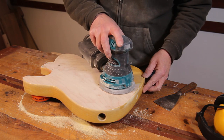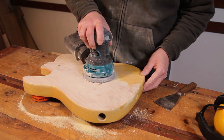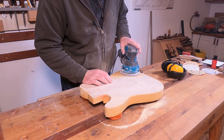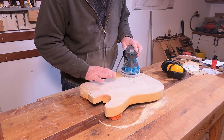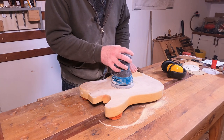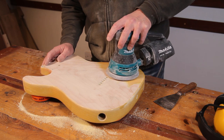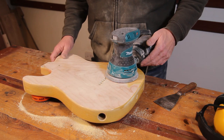What I've seen in my professional life is that people new to using this kind of equipment have a tendency to try and dig in with one edge to try and speed the job up. If you've got a lot of experience and you're working with finer grits you can get away with that, but only if you know what you're doing. If you don't, you can very quickly introduce unevenness and divots into your job. For stuff like this you really do need to make an effort to keep it as flat as possible, and then you'll end up with a beautifully flat, smooth surface.